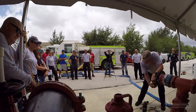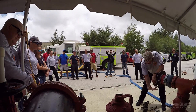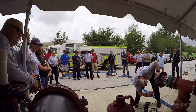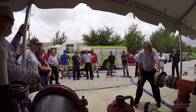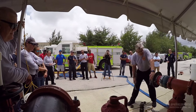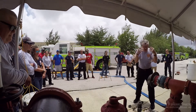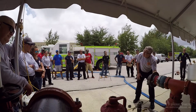We want to take these — these happen to be plugs; the plugs are caps with male threads. With a flashlight, check: is there a clapper? Are there gaskets? Is there an insect nest? You would be amazed at the vile things you'll find in here — I've seen cigarette butts, cigarette packs. If you need gaskets, go get some out of the apparatus. And it's going to be frozen.